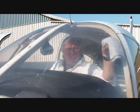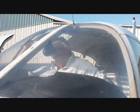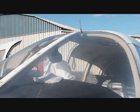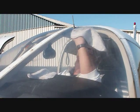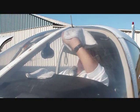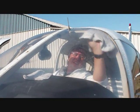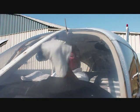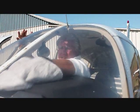After he's put on his first coating and gotten all of it off, he's now using a wetter rag and just putting a thin sheen of water on the windscreen that he just polished with the Acrylic Works. The next step will be to use a buffing cloth, which will remove the water and any of the other last pieces from the windscreen. You can already see a lot of that damage was actually on the inside because it's already probably 60% cleaner than it was, and this has only been about two minutes of work.